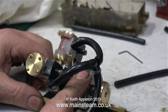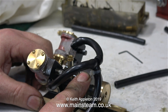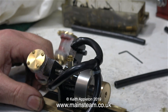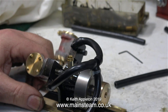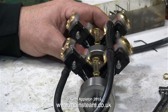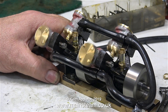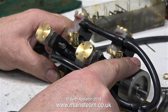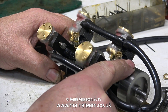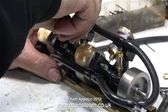These engines are surprisingly powerful, and therein lies the other problem. Just one of these Black Gates twin engines will easily power a six foot boat. When I connect an air supply to the front engine as well and run them as a pair, the power is quite astonishing — but it's too much for the crank pin that's linking them together. I currently have about 30 pounds per square inch going into this engine and the amount of pressure I'm putting on the flywheel is quite a lot. I'll just tighten up these oilers before they vibrate loose.